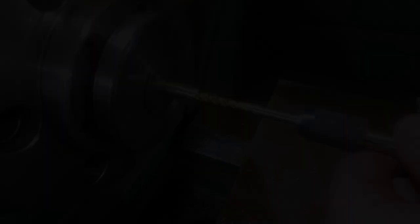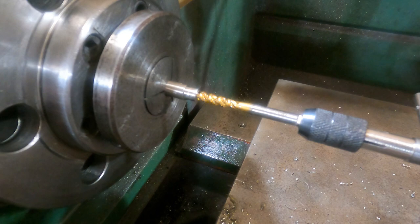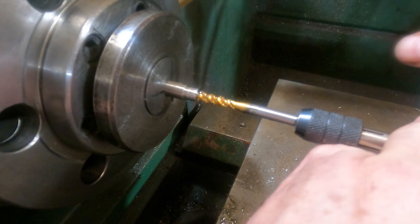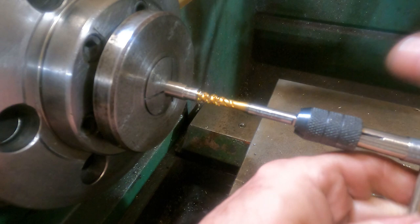We switch to the hand tap. I've modified my hand tap to work in the lathe. There's no forward pressure from the tailstock - this is strictly holding orientation. It's 100% by hand that we tap this. It's tough in there. These spiral flutes usually just drive in and tap nicely, but that work-hardened stainless is definitely something to contend with.